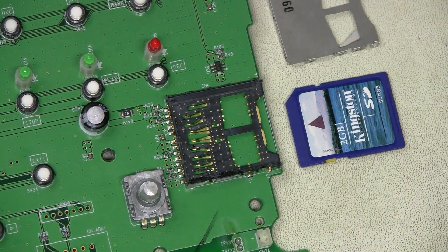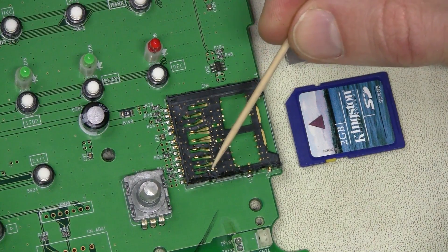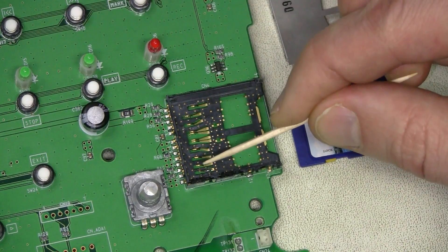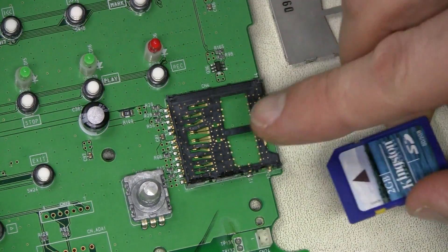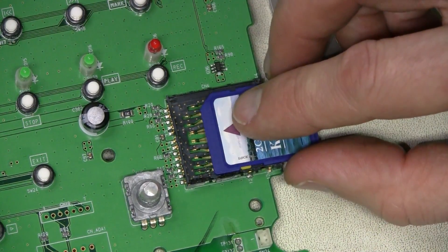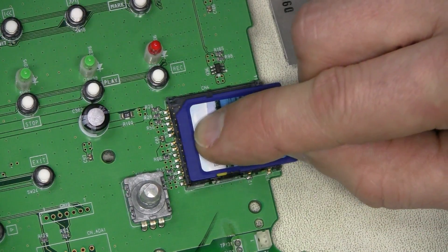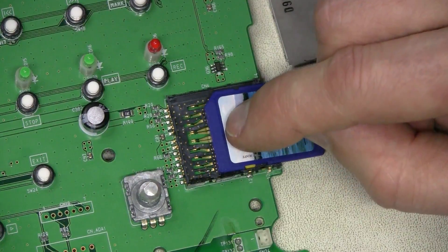So I decided to try fixing that pin, and I think I succeeded. It was broken right in the middle, so there was still a piece sticking out of the plastic, meaning it can still spring up and down just fine. I managed to solder it there carefully and it has the same height as the other contacts. When a card slides in, it doesn't sit right on top of that surface — it sits slightly higher on the plastic guards on the sides. So that soldering joint is not a problem; the card is not touching it at all. I can see when the card slides all the way in, it pushes the contacts down slightly, including the repaired one. So I believe this should work just fine.